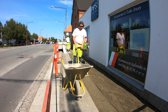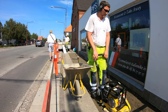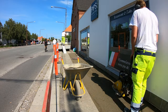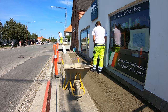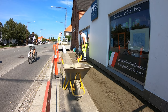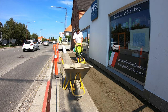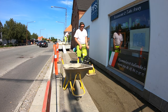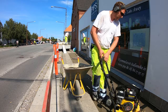The type of crushed rock used under the asphalt layer is crucial to proper drainage. The composition of the rock should be coarse and spiky — this type is usually called road base. If your underlying soil is clay-based, you will need 20 cm or 8 inches of crushed rock. If your underlying soil is sandy, you will need 10 cm or 4 inches of crushed rock. After that, stamp the crushed rock into the subsoil and allow this base to settle for approximately one week. Every day I would suggest watering it, except for the two days before the asphalt laying. Many contractors will skip this step due to time, but the benefit of allowing the base to settle is a stronger, more naturally settled base. If the base material is not allowed to settle properly, it will most likely fail from movement occurring under the new asphalt.